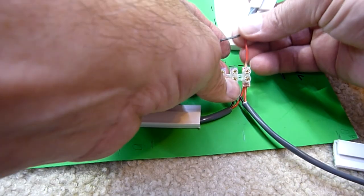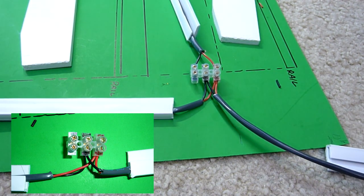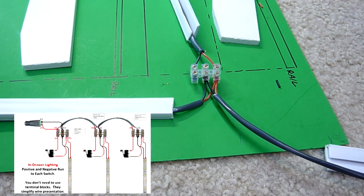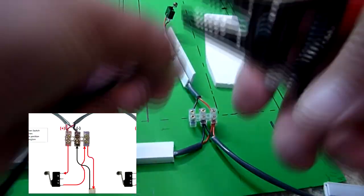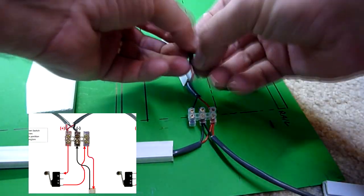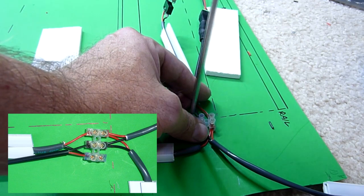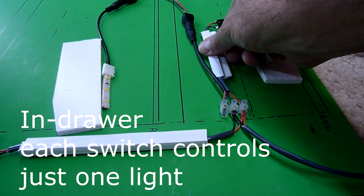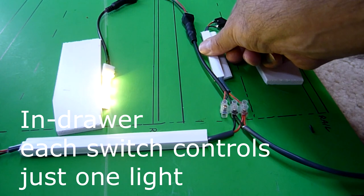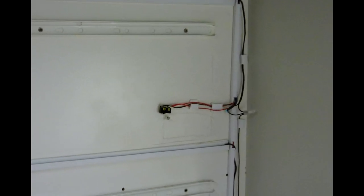Let's back up and look at wiring again. If we were doing in-drawer lighting, this harness would be the same but wired a little differently — we'd use a three-position terminal block. We'd wire the spine with the positive and negative into positive and negative blocks all the way down. We'd have a third position for the return power from the switch, and we'd take the light positive cable and plug it in that third position, and plug the light negative cable in the negative position — that gives us the light for each shelf. We'd be running a whip to the front of the shelf where the light would be installed. An in-drawer light set wired without terminal blocks is much messier with extra wires floating around — terminal blocks are much cleaner.